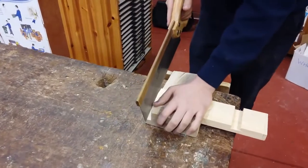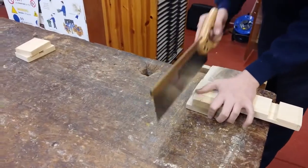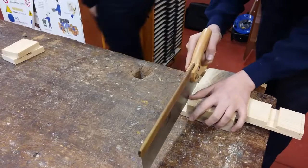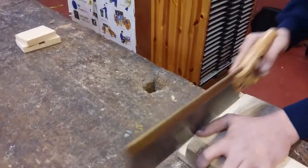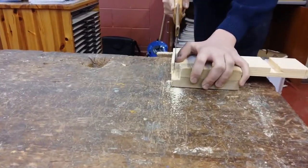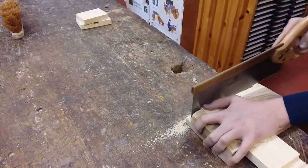After that you need to remove the pieces. We have a student here who is going to demonstrate the saw cut — setting it up in the bench hook, starting with the back stroke and using the thumb as a guide. You can see good back strokes have been taken to get the cut started, though he's starting into the full stroke of the saw a bit too quickly rather than taking the line the full way across the piece. Looking at the saw with the finger as a guide, keeping it square to the line, which is pretty good — the stroke could be a little bit longer.